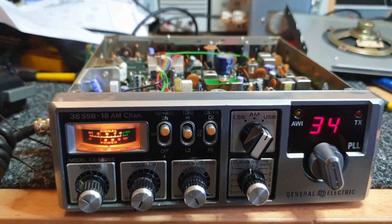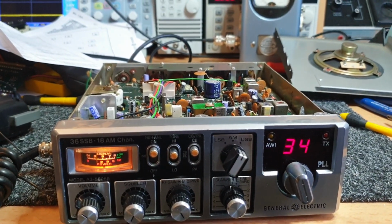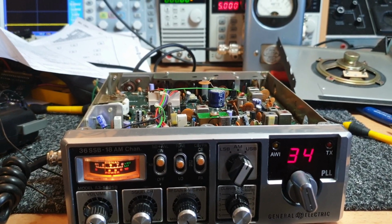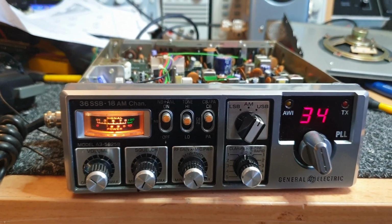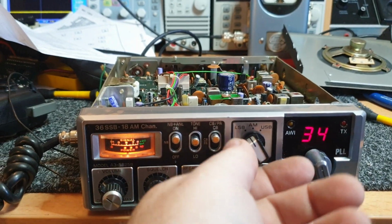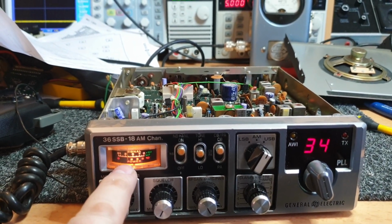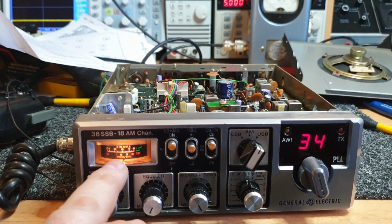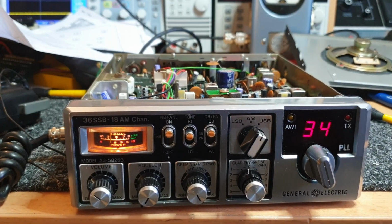But please, if you get a problem, no matter how good a tech you are, it takes a minute to 90 seconds to pull out the screws. And if you see something, hit it now, straight away. I saw that carrier balance and I thought, hang on, that can't be right. And I'm actually seeing one last little fault that I need to have a look at. As you can see, we're a little bit off on our balance here on receive on the oscillator. So we'll hook up our 10.0525, etc., and have a quick check of that, and just adjust that, because I would say we're just a little bit out.